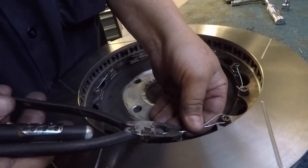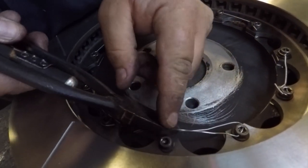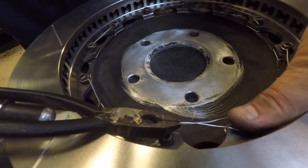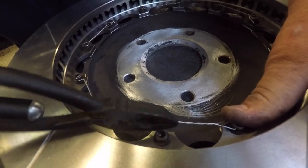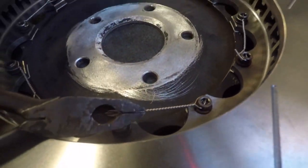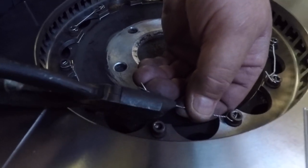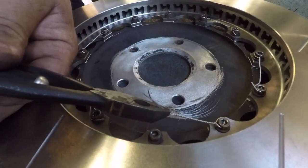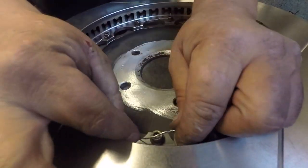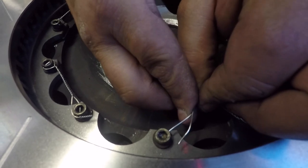When I clamp this, I'm going to clamp it just in front of the head of the bolt, so that we have a little bit of wire to manipulate through the hole. We're going to put our thumb over the top of the head to keep the wire from spinning up, and we're slowly going to spin until it starts to tighten — until we get that nice tight strand. Once it tightens up, we can back the pliers up a hair. Remember, keep the wire down nice and easy. If you go too fast or too hard, you will break the wire — trust me, I know.